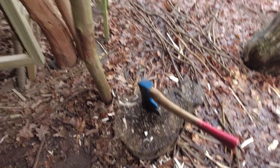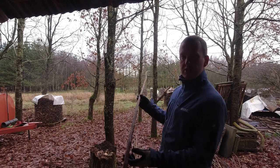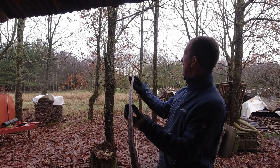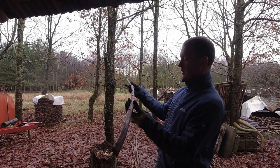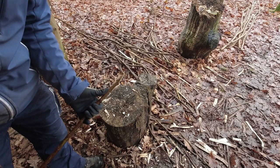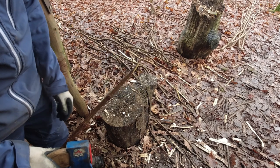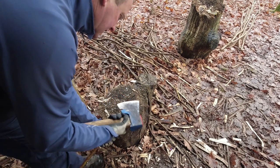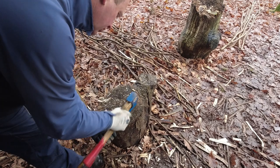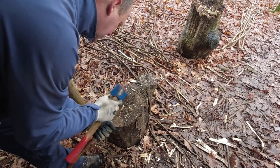So you've got your axe, your chopping block. The first thing you'll need is your rods — this is hazel. You want nice long straight rods, and you've got to dress them. I did a little video on dressing so I'll link to that in the description. With your rod selected, you want the thin end. I'm down to about half an inch — about the smallest I tend to split, between 10 and 12 millimetres. Pop it on the chopping block, bring your axe to the centre of the rod, dead centre. Lift the rod with the axe and then bring it down together.